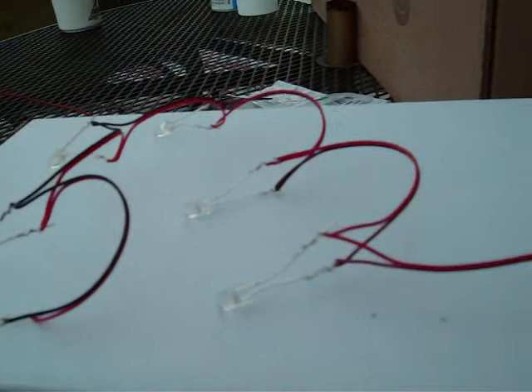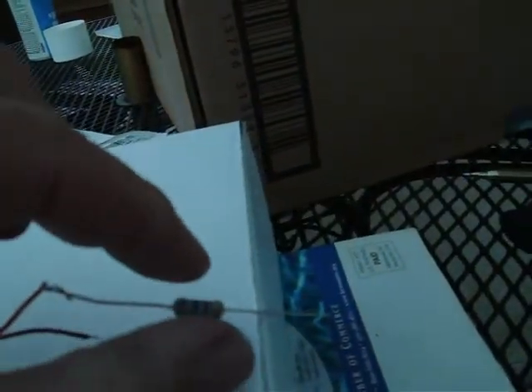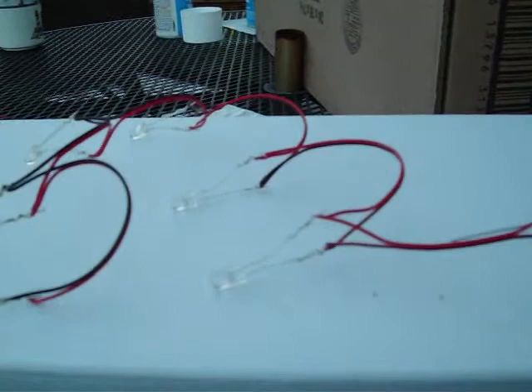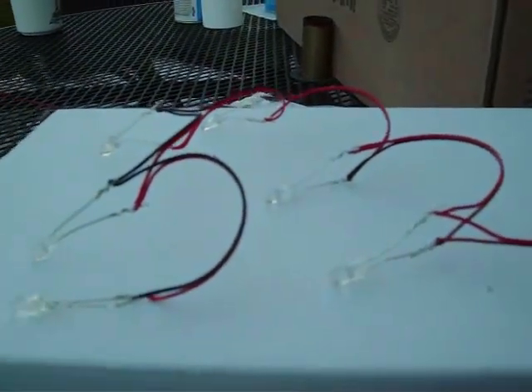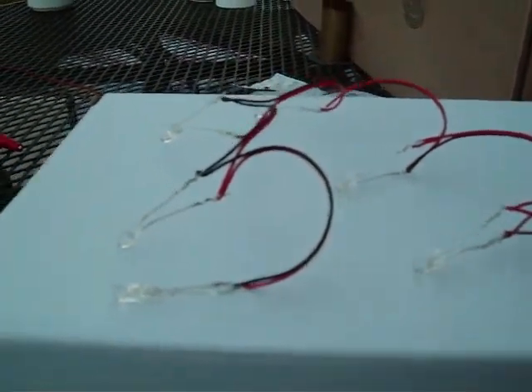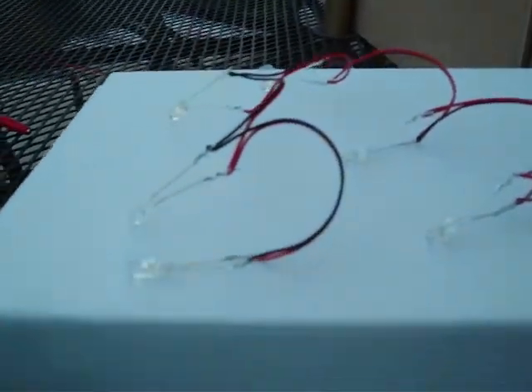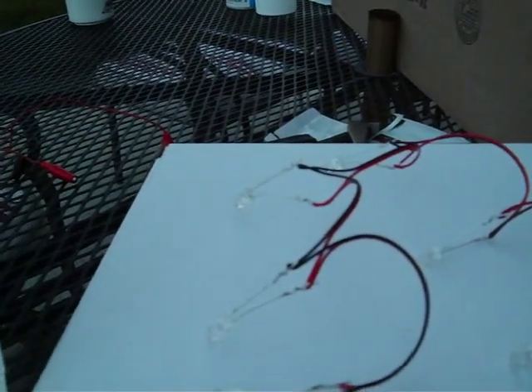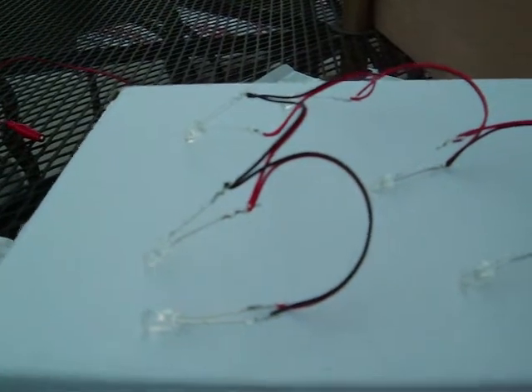I've got some better quality LEDs to make sure they last for a while, because I plan to have this model sitting around for quite some time. For these six LEDs, it's a 100 ohm resistor rated at 1 watt. My power source is going to be a 12 volt, 100 milliamp power supply — that's plenty of resistance in the line for that. I've already checked it and they do light up just perfectly fine. Each one of these draws 3.3 volts, and the milliamp current is 25 milliamps. 3.6 volts is the max on these.